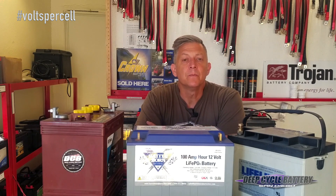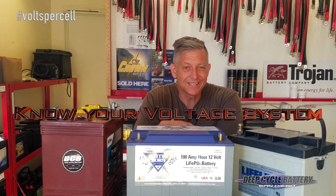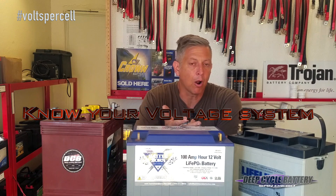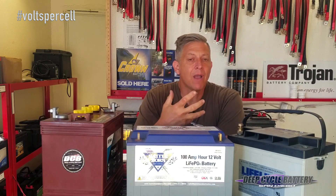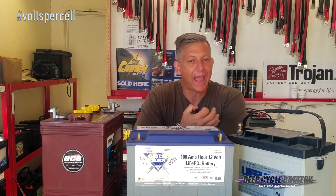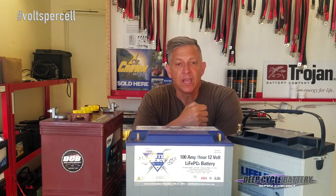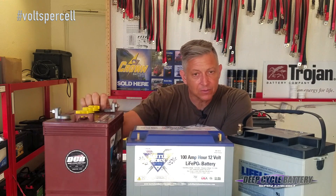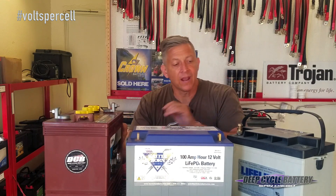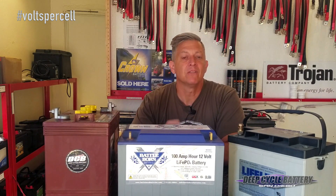The first thing you're going to want to do — let me give you a hierarchy of ideas here. First thing you want to do is know your voltage system, whether it be a golf cart, boat, RV, or solar system. You have a voltage that you operate on. For example, a boat house battery system typically is 12 volts, so you're going to have a series of 6-volt batteries all ran together, or a bunch of 12-volt batteries. Maybe you have a lithium iron phosphate battery, but you have a 12-volt system.